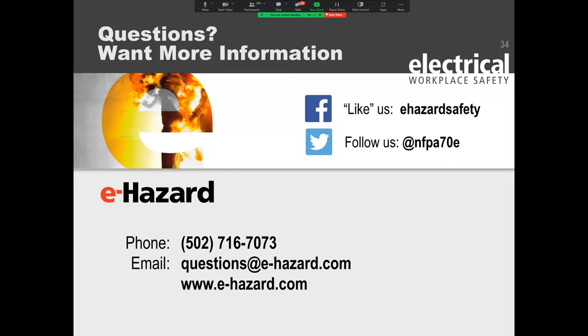This was a great question because one of the very big areas now is lithium-ion battery safety in EVs. There's another area called BESS, battery energy storage systems. Both of those, battery energy storage systems and lithium-ion batteries as used in electric vehicles and other mobile equipment, because we're seeing so many of them. We're seeing cranes, we're seeing wood chippers, forklifts, all battery operated these days. So NFPA 70E specifically excludes those. You can use their requirements as best practice, but be aware that the standard does exclude lithium-ion batteries as used in electric vehicles.